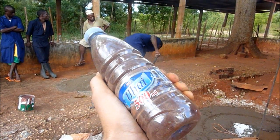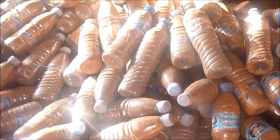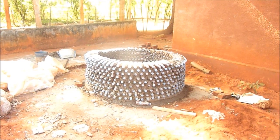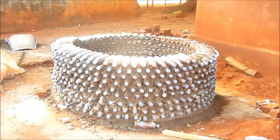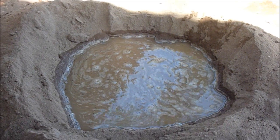After this it's time to start building the tank. We used about a 10 to 1 ratio of river sand to cement. Some people say that's too high, but it's worked for us so far. It all depends on the dimensions of the tank and the quality of your river sand.